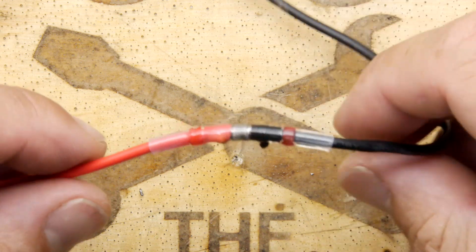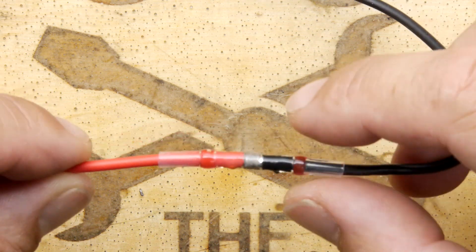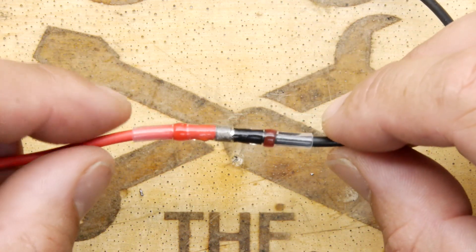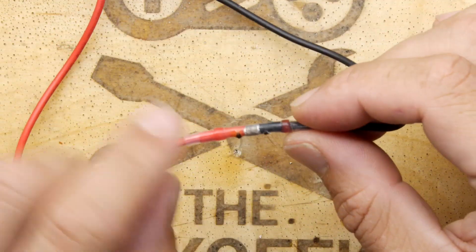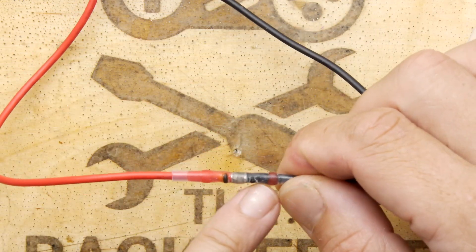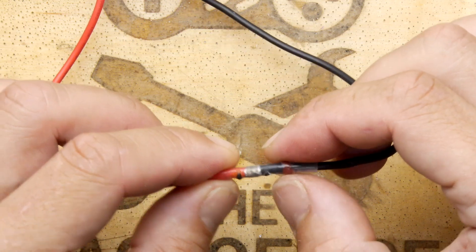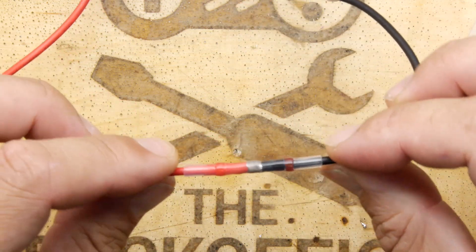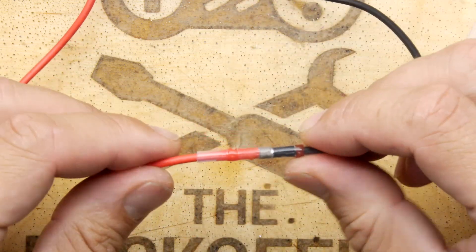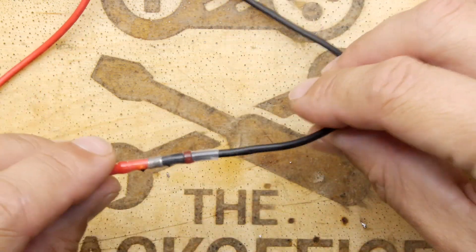It did actually start to catch — I probably worked it a little bit too hard. But you can see now that the solder is melted in there. The two blobs of strain relief are melted and the rest of the heat shrink too. I'm just going to hold it there for a while for it to cool down. There are a couple of scorch marks where I got a bit close with it — obviously you'll take more care than I did. But it is actually quite a satisfactory joint. Even though it did seem to rupture at these points, there's by no means any live metal there; it's still quite well insulated. I'd treat this okay for low voltage applications. If there's any damage and it's high voltage, just do it again or put a bit of heat shrink over the top — you could thread heat shrink over the wire before assembly and double it up.